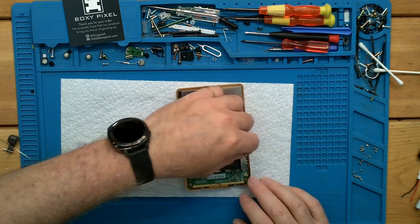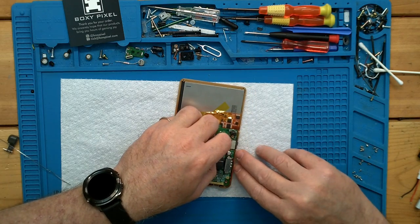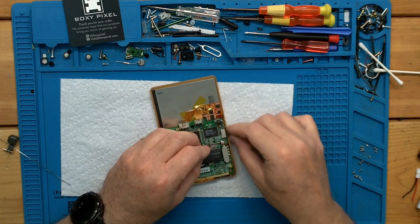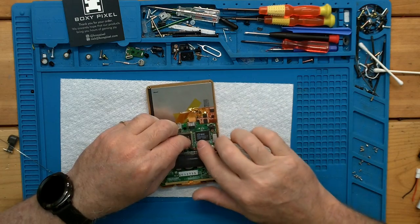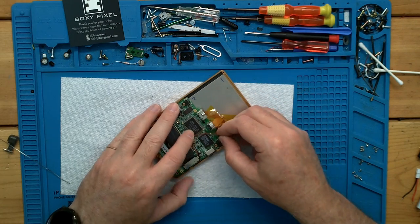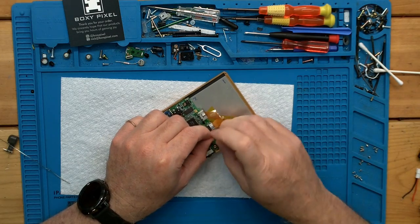So we can definitely come in just like this and around this capacitor. I'm going to tuck it in, make sure it's tucked into the shell. So we wanted to come around this little support, but we want to stay out of our volume slider. So we just want to tuck them in right there. And now we can trim them to fit however and wherever we want to solder these. So I'm just going to trim a little off this, strip it back.